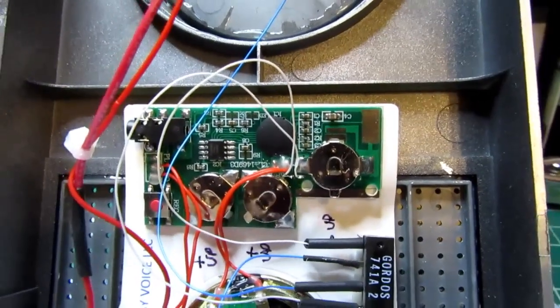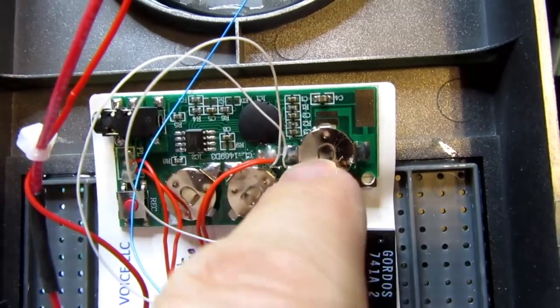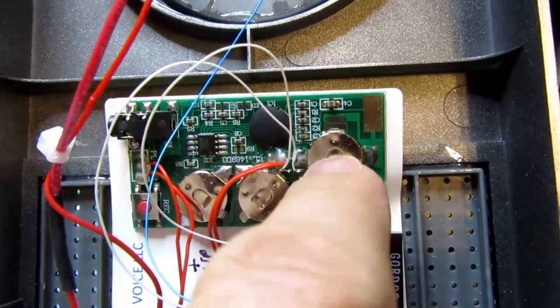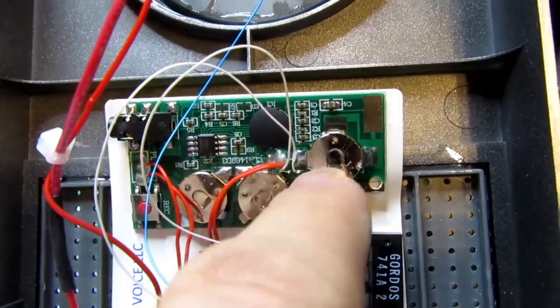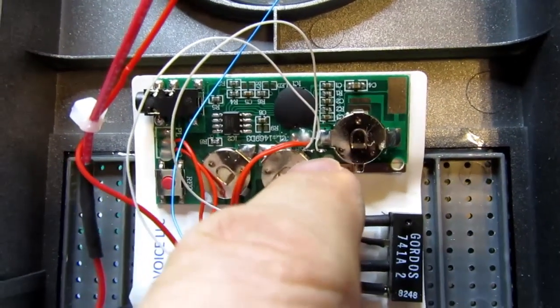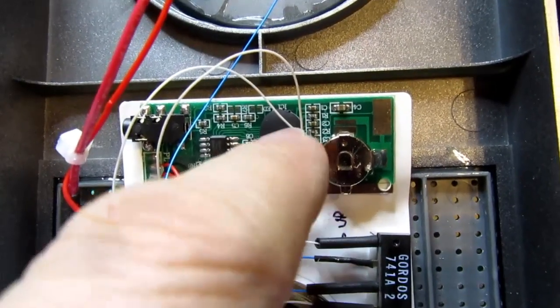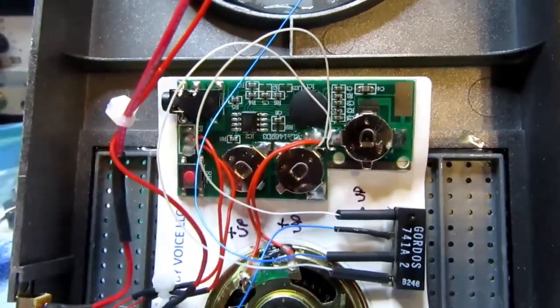That includes all three cells, or reinstate it by sliding the plastic strip back under the cell. That wasn't practical here, so I found that there was a foil on the top side of the circuit board coming from the negative side of this cell and going in between these two cells, right about where the tip of my fingernail is. That was an easy place to cut with an X-Acto knife and wire these two white wires out from that point.